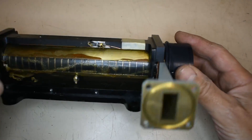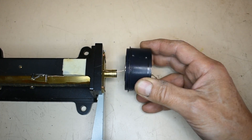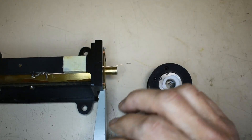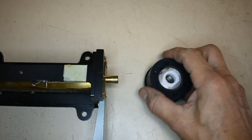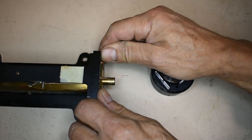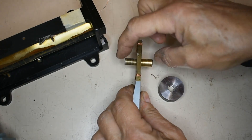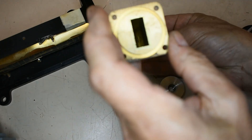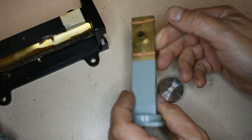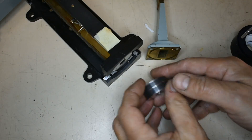Finally, pointing out these magnets here — if you take the anode end apart, this is actually the connection to the anode and it's connected to the chassis. Interestingly, this is the waveguide out. The travelling wave tube sits inside here and goes through the centre of that, and these are obviously shielding connections, with the rest of the magnets all in here as well.